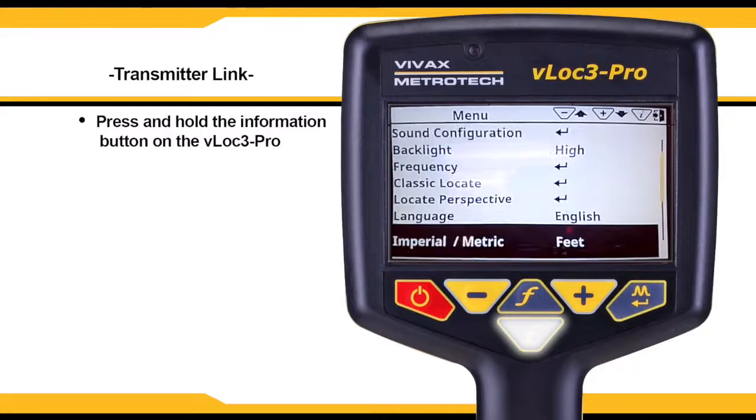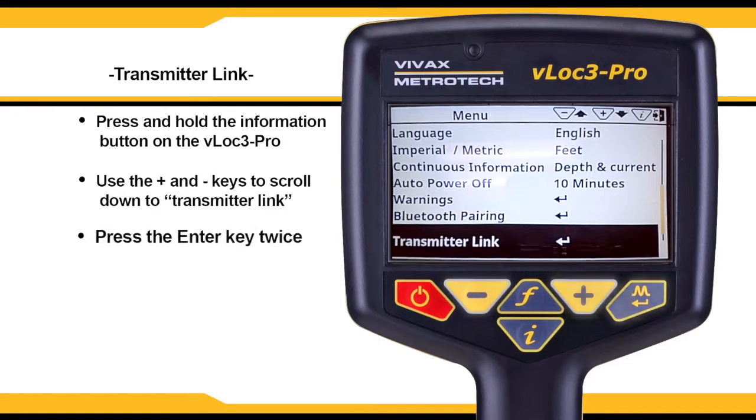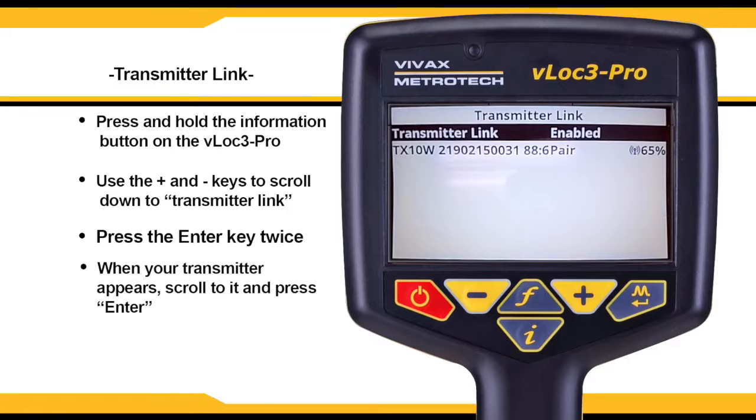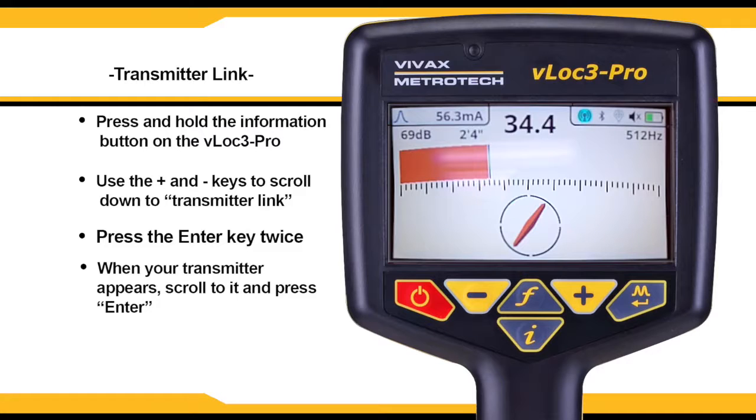Press and hold the I button on the receiver, scroll down to Transmitter Link, and click the Enter key. Press the Enter key again to enable transmitter pairing. The receiver will search for an available transmitter. When your transmitter appears, scroll to it using the plus and minus keys and press Enter. Your receiver will then be paired with your transmitter, and your transmitter ID will be displayed. Go back to the main menu. The beacon icon will be lit up if proper connection is made.